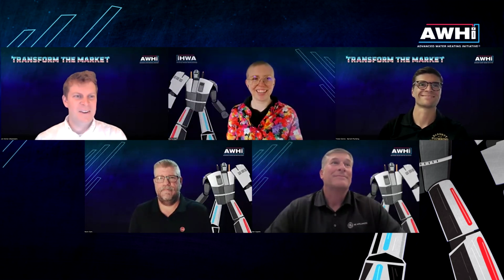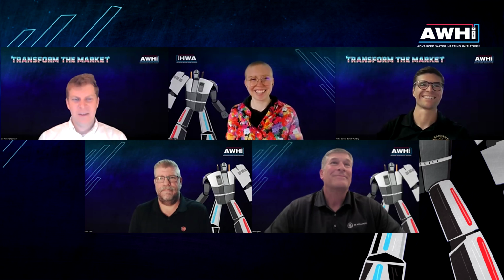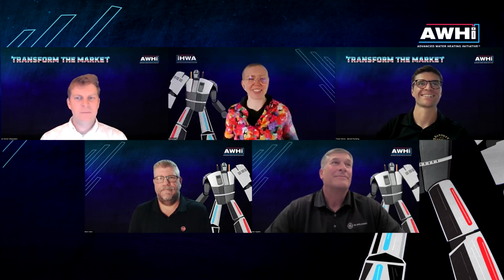I can jump in first. Hard water is just as much of an issue as it is for any other water heater. We haven't experienced anything specific when it comes to heat pump water heaters. We still recommend to flush it at least once a year. And beyond that, there's not any additional maintenance you need to do, depending on your water hardness. Yeah, that's great. I don't have anything to add to that. Fair enough. Well said, Tristan.